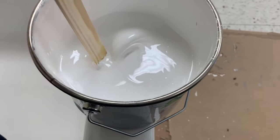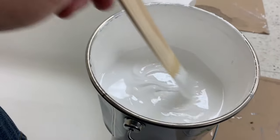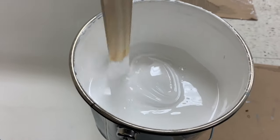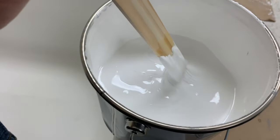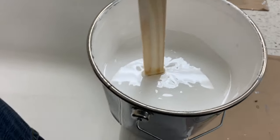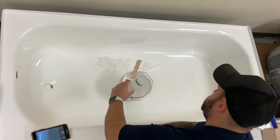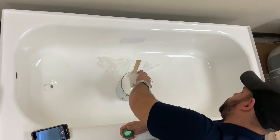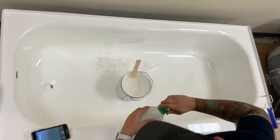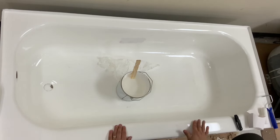We got it opened up and it looks like a little bit of the material has separated - this is a return can, so it probably went from hot to cold and back. Ecopel will not freeze, but sometimes some of the bonding agents separate. You want to stir this up before you pour the Part B into it. As a quick synopsis: pour the Part B into the Part A, then thoroughly mix it for 10 full minutes. Let it rest for 10 minutes, then give it another quick one to two minute stir, and from there you can apply it.